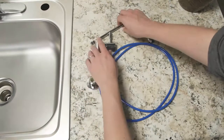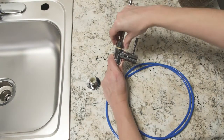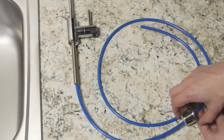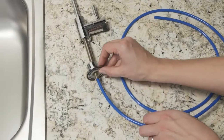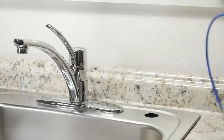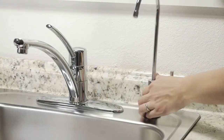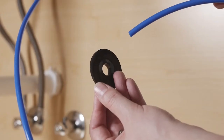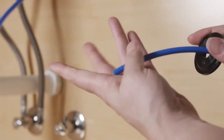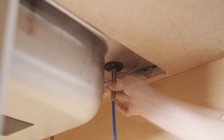To install the provided faucet, insert the top spout into the faucet's main body and screw the top cap clockwise until secure. Insert the faucet's blue tubing through the escutcheon and bring the escutcheon up all the way to the main body. Feed the blue tubing through the sink or countertop hole to the cabinet below. From under the counter, thread the large plastic washer flat side up, lock washer, and locking nut up the blue tube to the countertop. Tighten the locking nut until the faucet assembly is firmly in place.